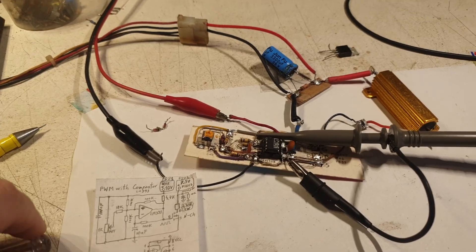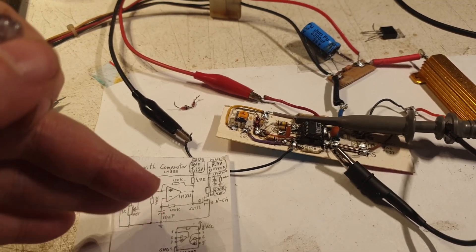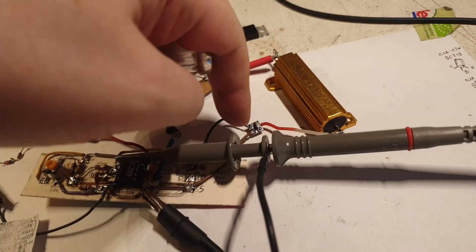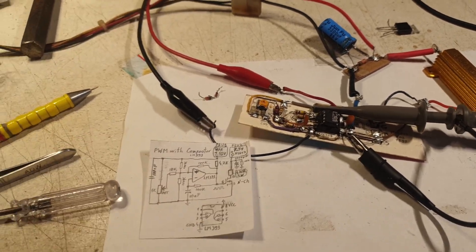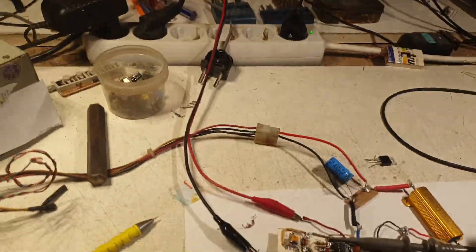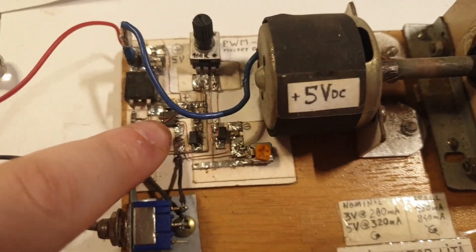I got two suggestions in my last two videos to make a 555 PWM circuit instead of this comparator-based one. It really doesn't matter how low or high I can get with the PWM — what matters is getting some PWM to test what's going on with the MOSFET gate. Even if it's not perfect, it's good enough for testing. I actually built a PWM circuit with a 555 — you can see it in the back — with a scrapped MOSFET.